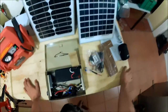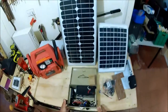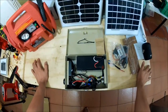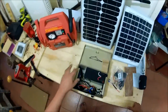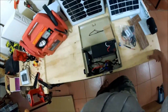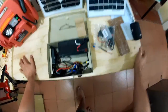This is a PWM — pulse width modulation — charger. It's not the most efficient, but when I started building this about a year ago, on and off, it's been cheap and cheerful just to suss it out and see how it works. I actually have a few MPPT — maximum power point tracking — charge controllers on their way from China, and we'll see if they increase charge efficiency. It should improve things by around 10% to 30%; I really think about 10%, but it all helps.